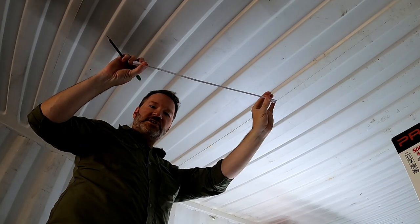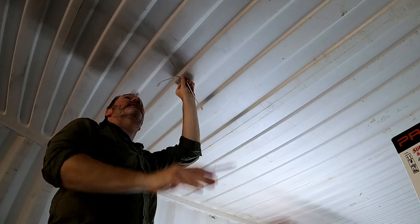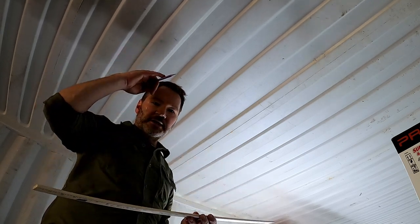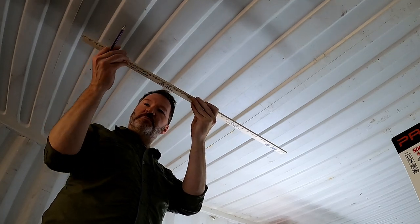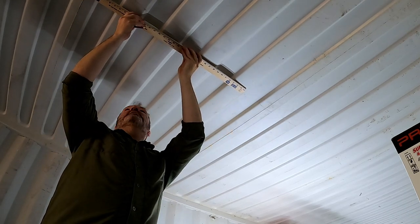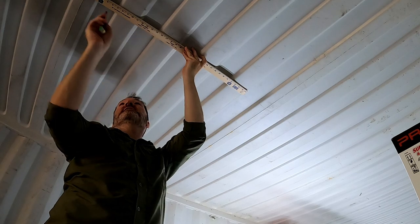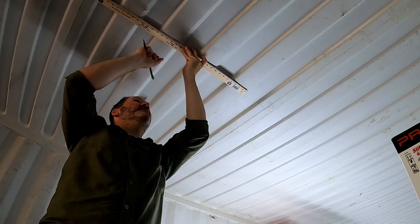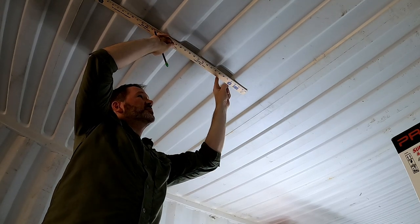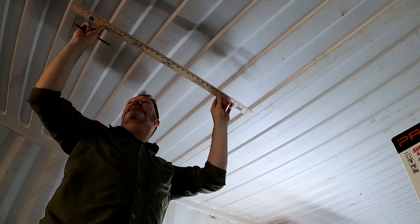This is the cord that goes between each light and it comes with the lighting system. Fold it over and mark where the middle is, and now I know where my end of the light is going to be. The light is 10 inches longer than the yardstick, so it's 46 inches per light. Keeping that in mind — and it doesn't have to be perfect because the light itself slides in those clips — I mark where the magnet's going to be. On the side of the yardstick I put a hash for where the clip is going to be. That screw is going to protrude a little into this void, which is fine — there's plenty of room. I mark on both sides where the clips and magnets are going to be.